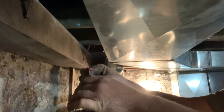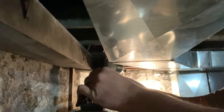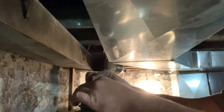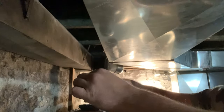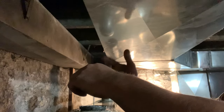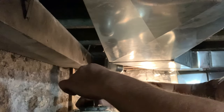Now remember, you're going to want to lift this up. What that does is it keeps it from hitting the sides of your tank, because if that armature is down, it's going to flop around and hit your tank there. And they even have an arrow on it to show where the armature falls. Ideally, you want it towards the vent, not the crossover, so when they're filling it, if you want to watch your tanks, it's not going to flop as bad up and down, but it doesn't really matter. There's no need to watch your gauges.